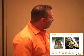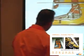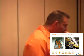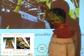But one thing when you're building things out, you really want to take some things into consideration. If you're going underneath the floor, you really want to think about a conveyance system. Number one, it protects everything underneath the floor. It usually keeps fiber and copper and power separated from each other. But the main thing it does is establish paths, because you never know when you might get trace up underneath the floor. Number two, we have the overhead conveyance system as well.